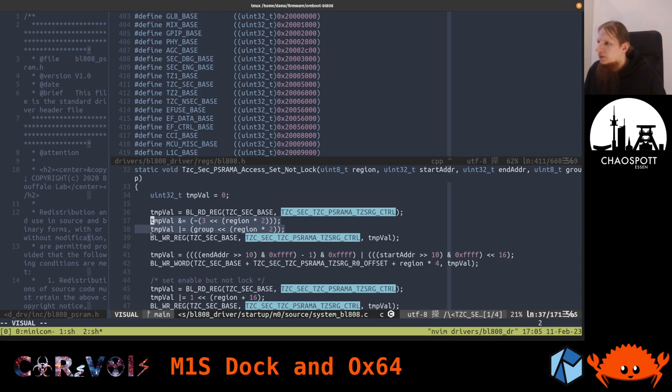So let's just copy this here for now. Actually, in our case, it wouldn't do anything. This here would be like all F, right? And then we would OR it with this here, which would be all 0 again, because this here is 0, this here is 0. Essentially, we would just write FFFF into this register. Okay, and then whatever that would do,